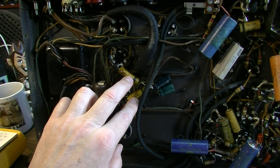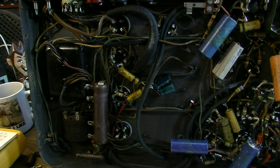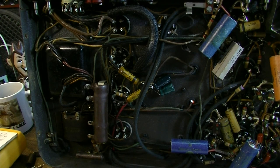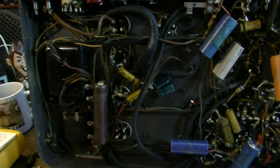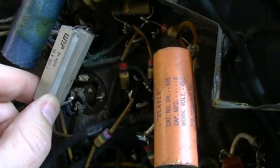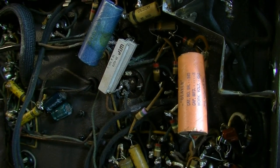I've got these, I think, are coupling caps, or maybe some kind of bleeder capacitors, stabilizing the thing. I'm not even really sure yet, but we'll see. I've got these two capacitors right here that I don't even think are the right values that replace some capacitor over here that exploded at one point. And you can see all the milky crystallized crap that's over there.